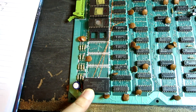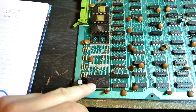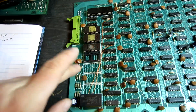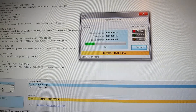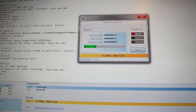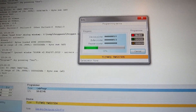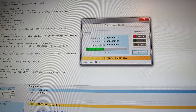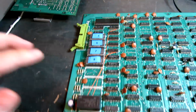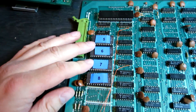In this case it's an STM48Z02, and the last job now is to burn the ROMs. Here we are programming the ROMs for this modification. The ROM images were made by a guy called JROC, so if you want to find those, just search for JROC — it's fairly easy to find. And there we go, there's the four newly burnt ROMs installed.